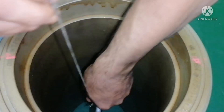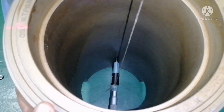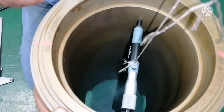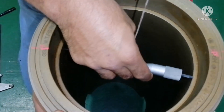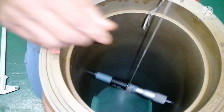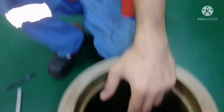Once you tie a rope, you can hold it, see the reading, and it will also be easy to lift it up. In the same way, go for the other readings. One reading at each position: one here, one here, one here, and one here. Similarly for forward and aft — one, two, three, four. This is how you need to calibrate your cylinder liner.